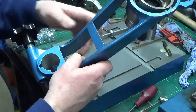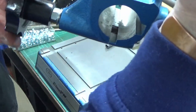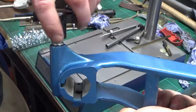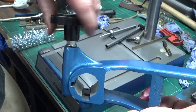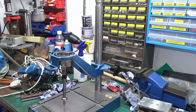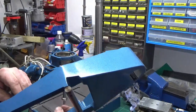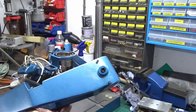We were struggling a bit because I took an M8 nut off that was very rusty and I'd lost it in the batch of parts. Anyway, we've got it in there now - that creates the correct level of friction using the bevel washer into the pinion, so now when I turn it, it turns the pinion gear to move it up and down the rack. As you can see, before it was all wibbly wobbly but it's now nice and straight in line with the axis of the pinion shaft.